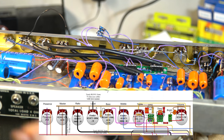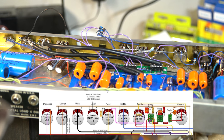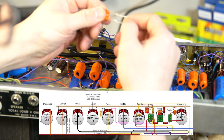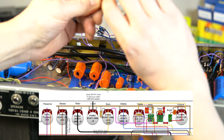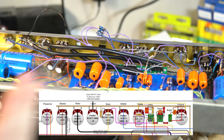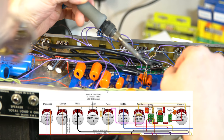The last things on this switch are a couple of ceramic capacitors that are back-to-back — it jumps between one and the other and we take the output from that. I'm going to connect these two together, put a bit of shrink tube on after soldering. What do you get when you jumper two capacitors in series? It halves the capacitance, so this would be 0.005. In parallel it doubles. Capacitors are the opposite of resistors — resistors in series add up.